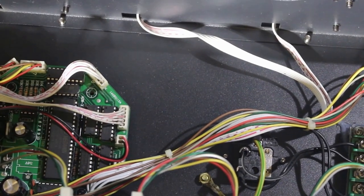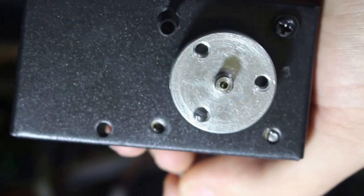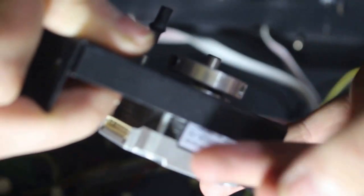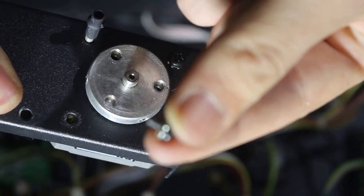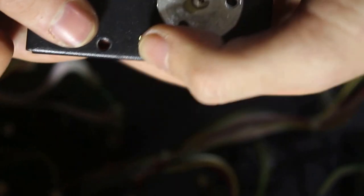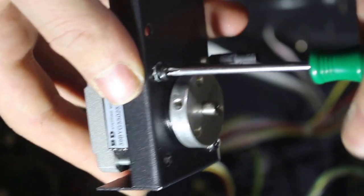So one thing I've noticed is that, maybe you can see it, maybe not. The screw is actually quite shallow, so I think all the screws holding the motor together are quite shallow. So I think maybe the screw that's holding it is too long, so I just added a small washer to see if that fixes the problem if I screw it in, because it doesn't want to go any deeper. I can't turn it more, so I think this screw is hitting the bottom of the silver screw from the motor. Okay, let's try this again. Hopefully the screw doesn't fall out this time.